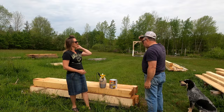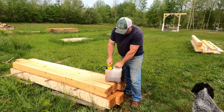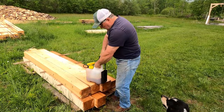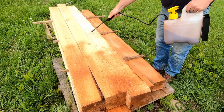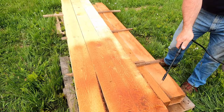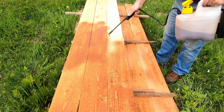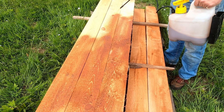I'll show you the process. We use this spray applicator — just pump it up, you know how they work, just a typical garden sprayer. So you get good pressure in there, lock it in, then I just go and start spraying. You can really see as I spray this on here, it really does a good job. Just go nice and even. Now this is just the first coat. What I really like about using this brown color is that it really makes the grain of the wood stand out really nice. It actually looks like I'm putting a stain on it, but I'm not — this is just a wood treatment. You could stain it afterwards, no problem at all. But this is going to guarantee the integrity of your wood.